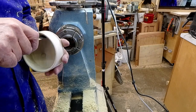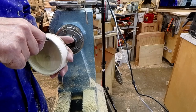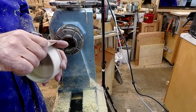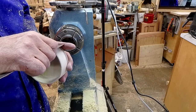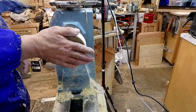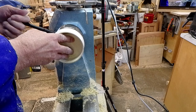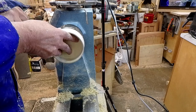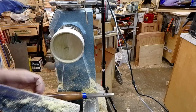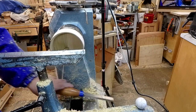So we've probably got, we could probably go another, see, 26, 29, we're at, say, 29 millimeters here. We have 40. We could probably go down another 7 or 8 millimeters deep. So let's go ahead and do that. And we'll take a box scraper and go in there and take another 6 or 7 millimeters of material out.